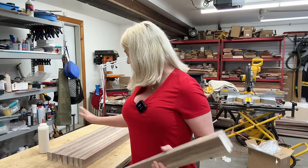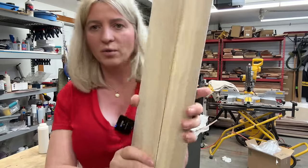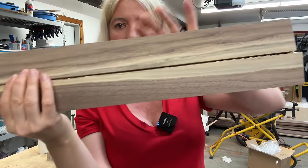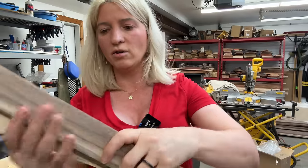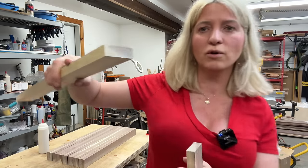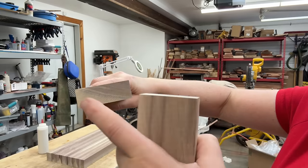What am I looking for on these boards when choosing which ones to use? If I look at this board on one side, it looks all sappy — not so great. The edge grain shows nothing special either. But remember, we are making an end grain cutting board. So if we look at the end of the board, you have this diagonal line where the sap meets the hardwood. If I take two boards with a similar pattern, now we have half of a diamond.